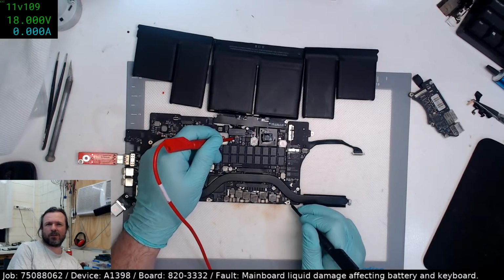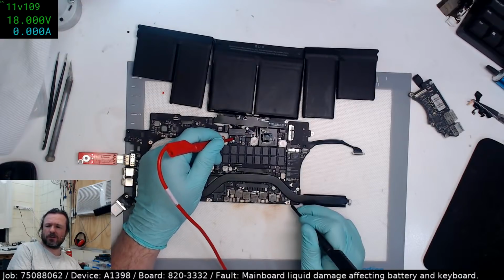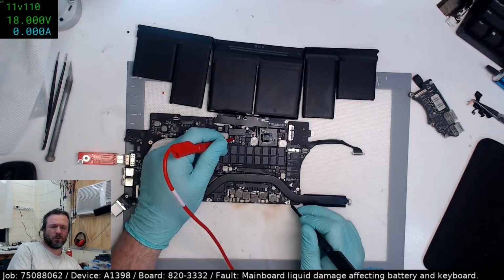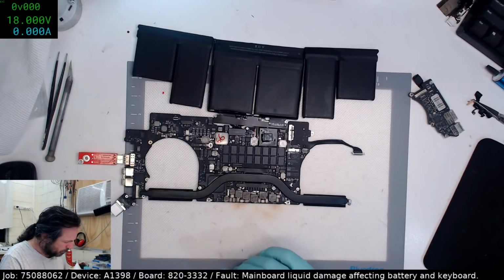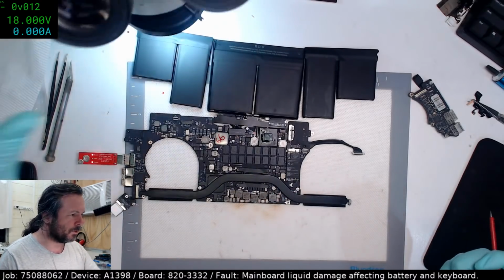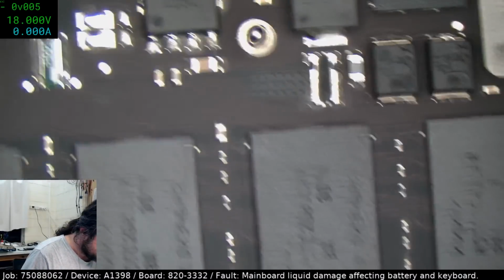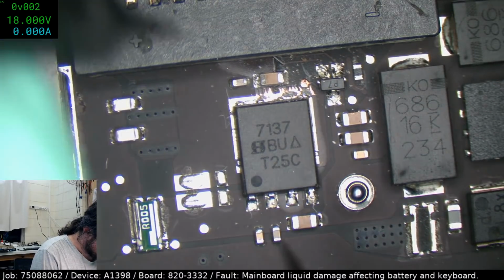Yeah, it's already over the threshold point, so it should be doing the normal higher rate of charge. It should be applying about 12 something volts to this, not this abysmal 11 volts. I don't know what to blame here, to be honest. Let me have a look at the voltage drop across that MOSFET. I have to do this under the microscope because I don't want to accidentally kablammy anything. If I blammy it, I'll be in big trouble. I'll blame everybody except myself.